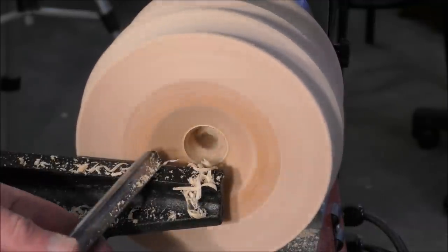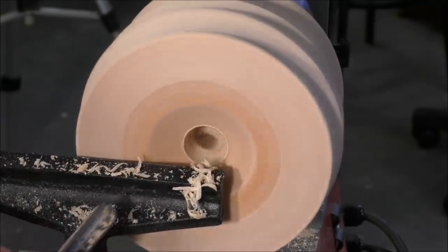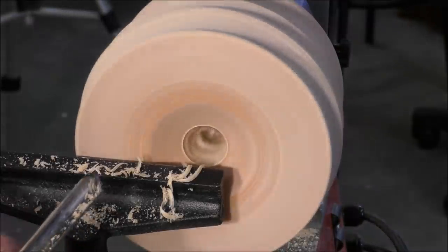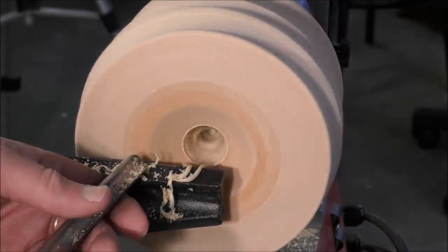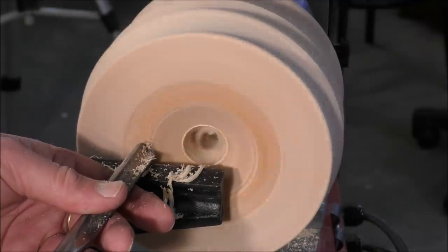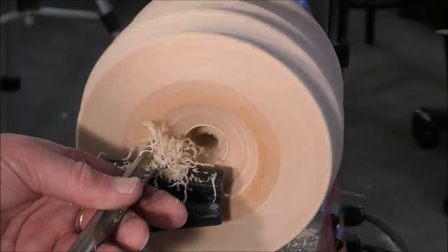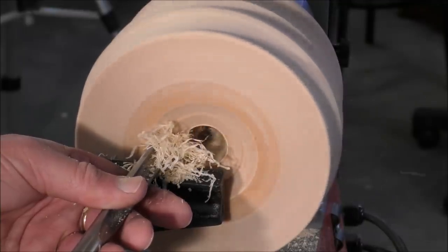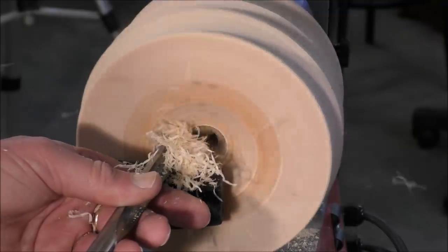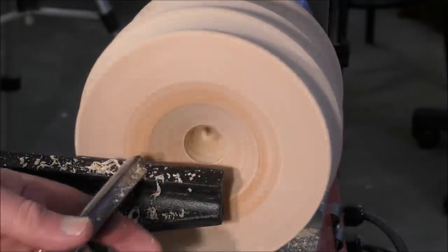And if you can't see actually where you're cutting, by where the actual edge is cutting, what you do, you look at the cut on the opposite side. That's one of the secrets. You don't actually look after the initial cut. You're not looking at the cutting face, because you can't see it because you've got all the swarf. You're looking at the opposite side of the material to see how the cut is performing.